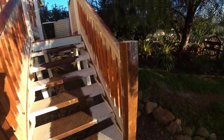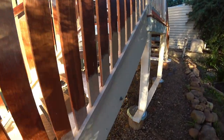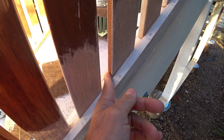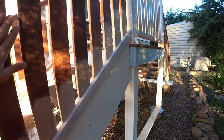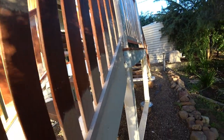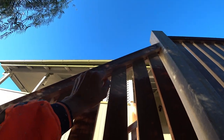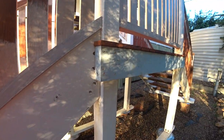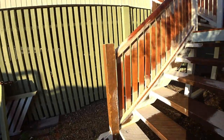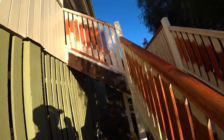Now it's all hardwood. Look here - the builder has primed all the ends and primed up underneath. That's one of the most important things: if you come across a set of steps that someone's built and they haven't primed underneath these areas, it's going to always have a tannin stain that comes through and there's really nothing you can do about it. You could paint it in darker colours, but when it rains or there's dew, you're still going to have that stain come through.